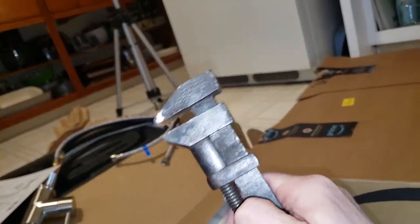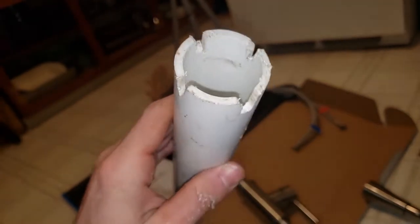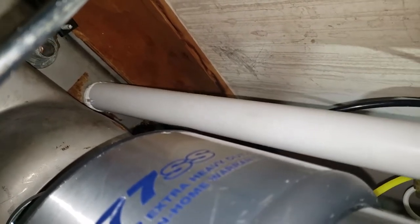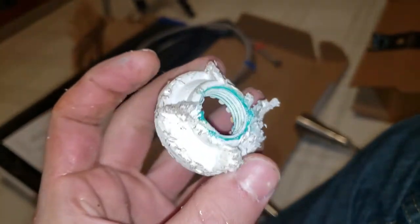Undo your water lines and discover how difficult it really is to remove plastic nuts in a tight space. I fashioned a fancy tool out of one-and-a-half-inch PVC pipe — I just notched the end. Look at that chewed up end — it's done, get out of here.